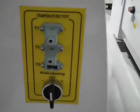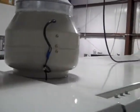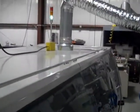The computer interface is here and also down on the left side of the machine. It has thermocouples as well as a width adjusting switch. It has a UPS on-off switch, a lighting switch, and a computer control with an emergency stop. The oven has two exhaust ports: one by the fluxer and one by the reflow zone.